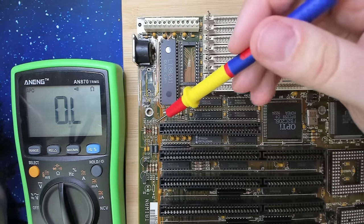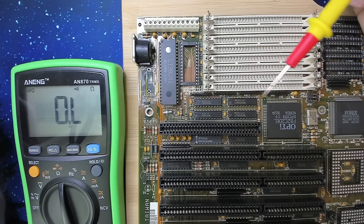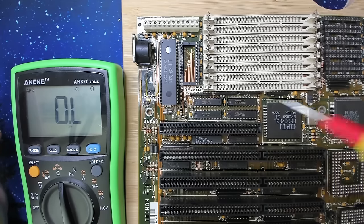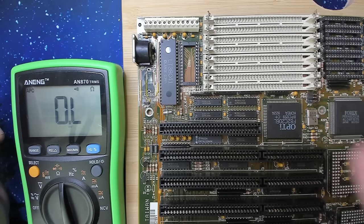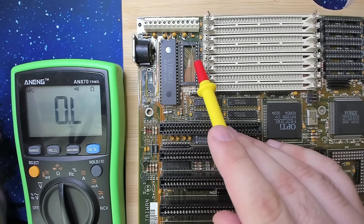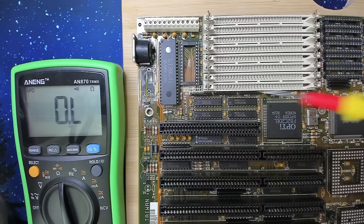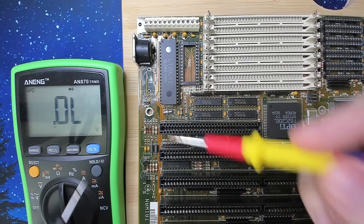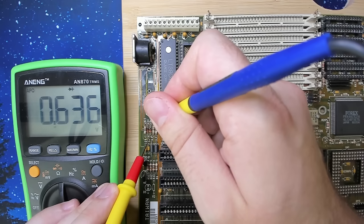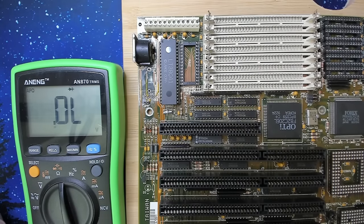I don't want to just go ahead and disable or remove this diode right now. I want to actually see how it behaves first. So we are going to power up this board now without any CPU or memory. This gives the advantage that we can test the board first and see where there may be other problems. For instance, we have tantalum capacitors — I have seen other YouTubers and friends where these ones blow up, so I have to be a little bit careful about those. We can then measure the voltage we get here.